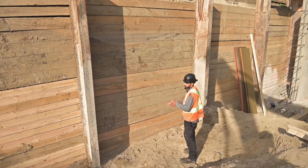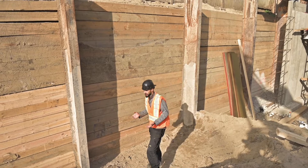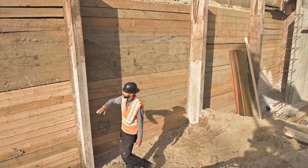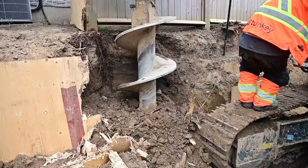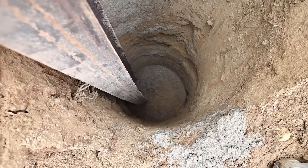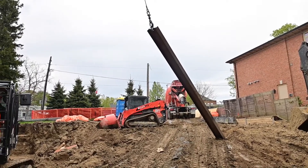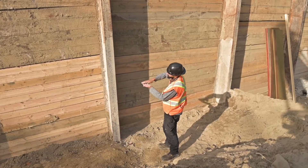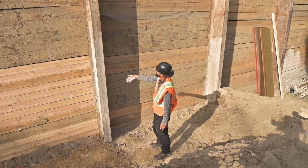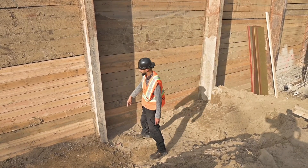In this scenario they're gonna spec shoring, and you can look at shoring as basically an underground fence. They come in before anything is excavated and they drill holes deep and insert these piles. It's basically a steel I-beam that they'll sink in at least twice the depth of what is planned to be exposed. So if there's 12 feet of exposure, they'll be 24 feet down into the ground.